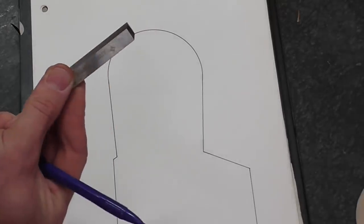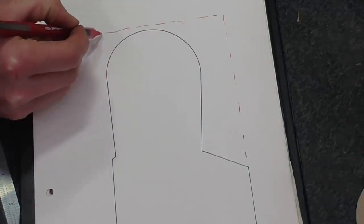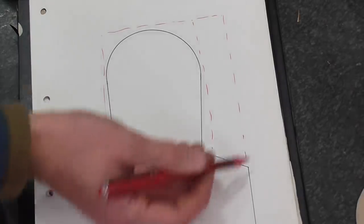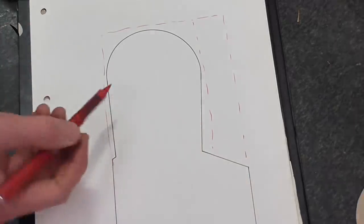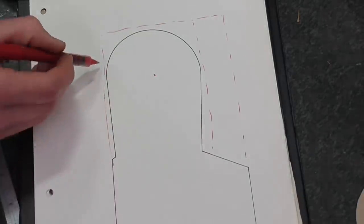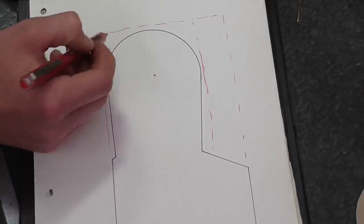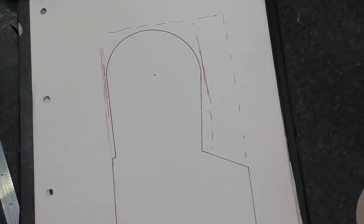It's going to come out of a piece of three-eighths high speed steel. The starting blank will obviously be a rectangle and I'll be grinding all this out. The first thing to do will be to block the side out — and you'll see in this video I don't do it particularly efficiently, I have to have two goes at it. When you come to block a tool out like this it's very easy to say that's the radius, so I'll start by grinding to that diameter, but invariably you find when you start blending the profile you end up undersized. I always leave the starting blank quite a bit wider than I'm hoping to end up with.